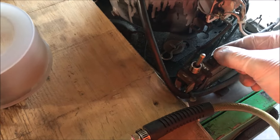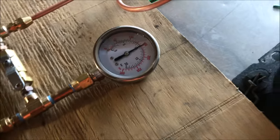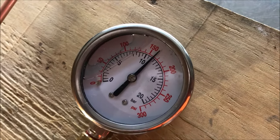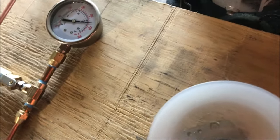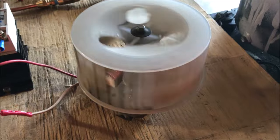Now let's try the next parameter — we're going to cycle the pressure side. To do that I need to use this homemade high-pressure pump. We're pressuring up very rapidly. We want to hear the gas — wait, we had to wait for that to turn back on. As soon as we get to about 250 PSI that should shut off. Hopefully this fan kicks off as well — that's what we really want to see happen. And there you go, Carlos — the water pump just shut down.